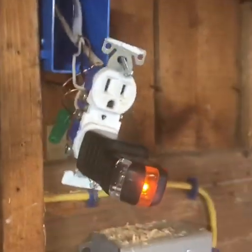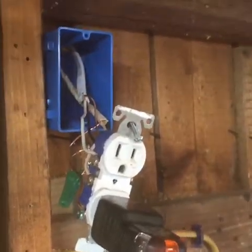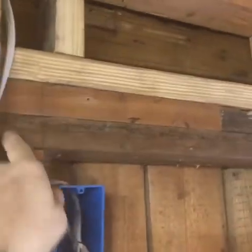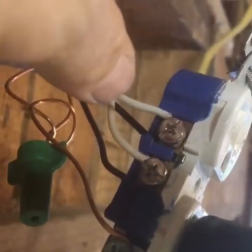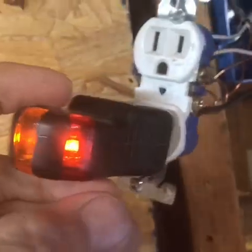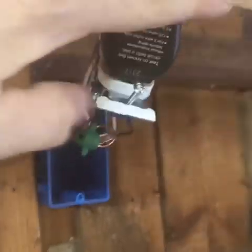What you need to do is bring your wire from the light — again, it's a single wire coming down into the junction box — and just put it in the other empty spot. White on silver, and your black wire from the light on the other side.